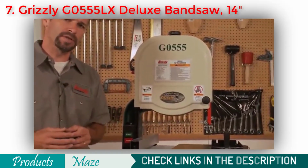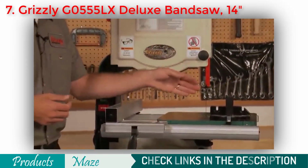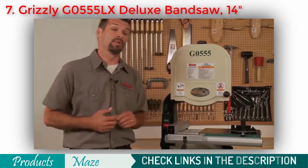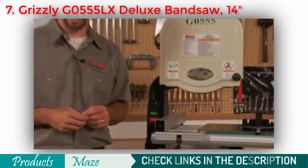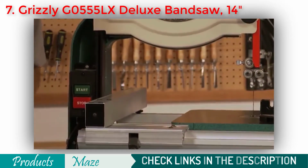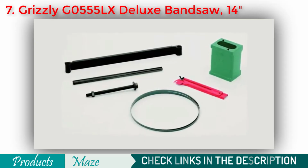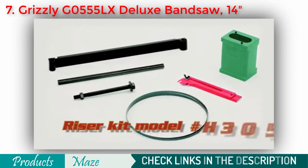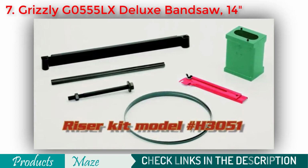Generally, when you refer to a 14-inch bandsaw, it is the distance from the blade to the saw's frame. The resaw capacity, or how tall a board you can run through this saw, is 6 inches. This particular saw also has an optional riser kit available that will give you an additional 6 inches of resaw capacity for a total of 12. The kit's model number is H3051, and the kit includes a block, guard, and a longer blade.